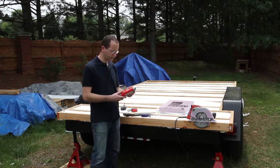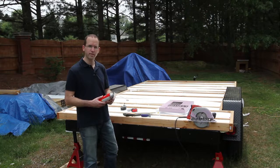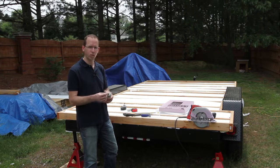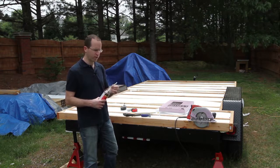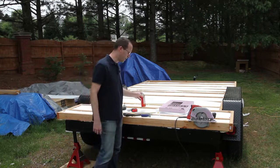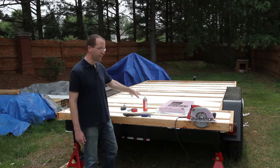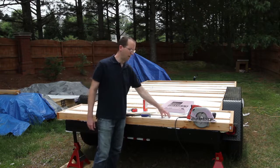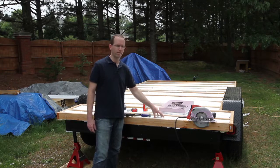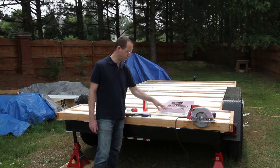As I put the panels down, I use Great Stuff Gaps and Cracks to fill the cracks. There are a couple of products out there; this one is really common. The tube is a little flexible, which is a bit of a pain to work with — a rigid nozzle works better, but this is what I had available. Apply it on each layer. You don't want to wait until both layers are in, because the upper levels may hide cracks in the lower levels. Spray the lower level first, then go back and spray for each subsequent piece.